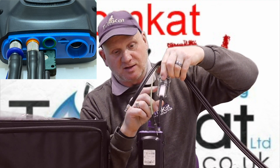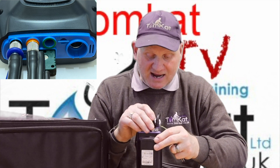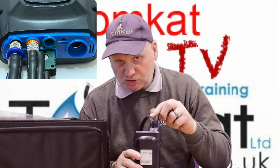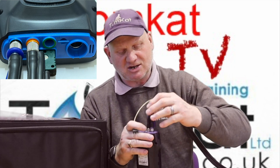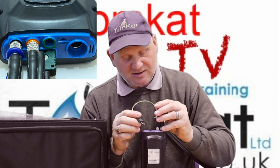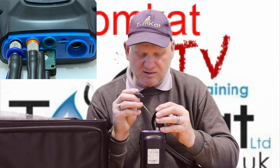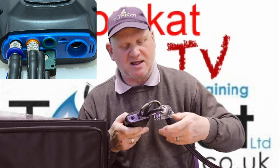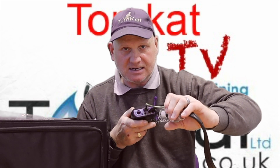You plug in your black one and you can see the black O-ring connector going into the bowl. This orange connector is just to blank off your positive pressure — that's your P-plus pressure sample point. It's not two connections, it's just blanking off that port so you don't get dodgy readings. The standard K probe goes in with the small end into the small bit and the bigger end into the bigger hole.